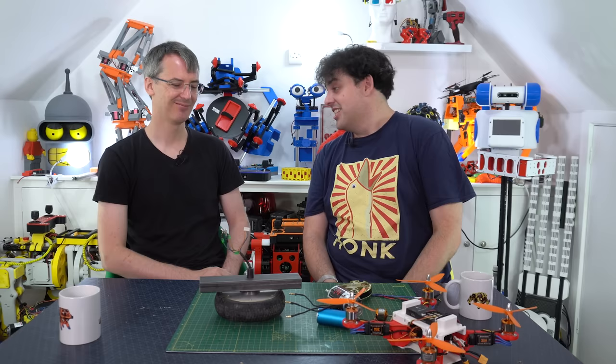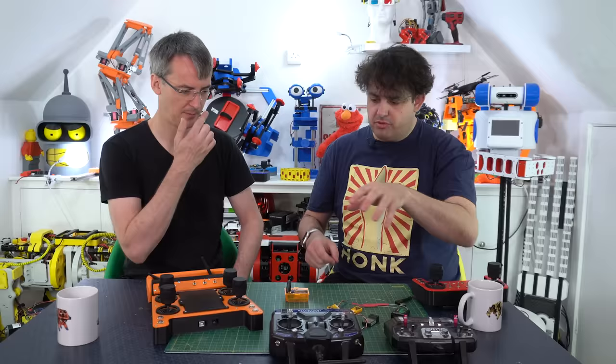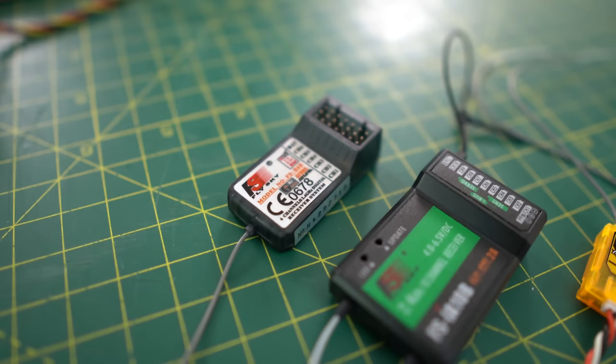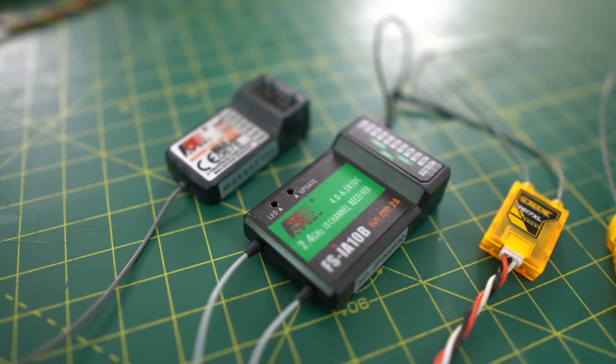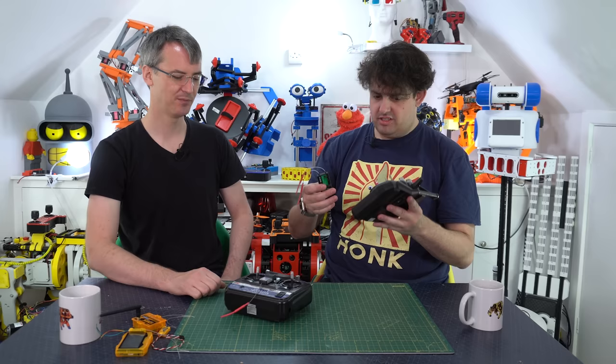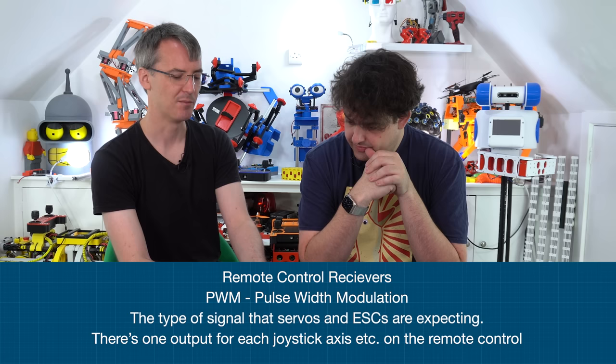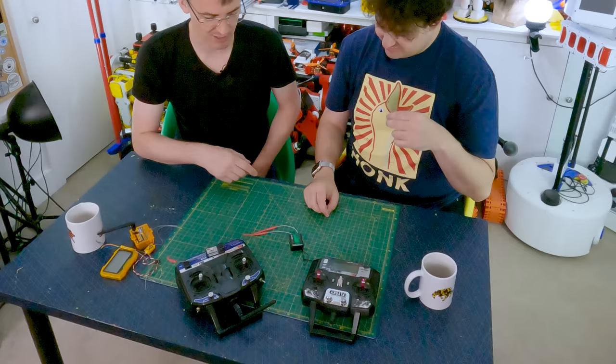Radio gear. We've got three different types of controllers here, each using a different protocol - a different language to talk to its receiver wirelessly. The receivers have different types of outputs that can individually plug into separate items, or give you the full joystick and button information all on one wire. These generally come with a receiver, or you can buy spare ones that plug into ESCs or servos. What comes out of the receiver is a PWM signal - that's the really basic one. This receiver has a lovely LCD and more interfaces - a bunch of PWM outputs for servos or ESCs.